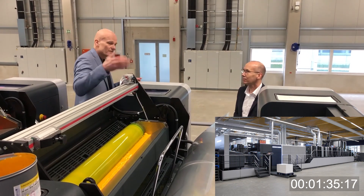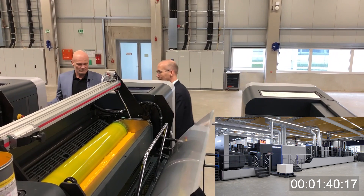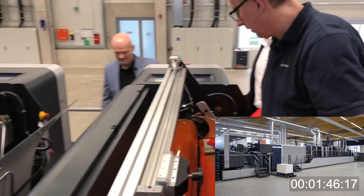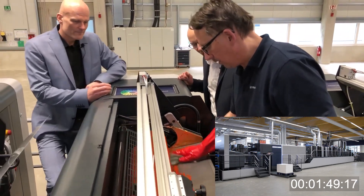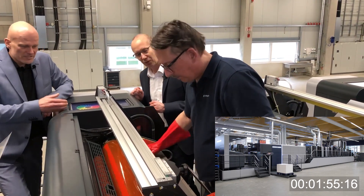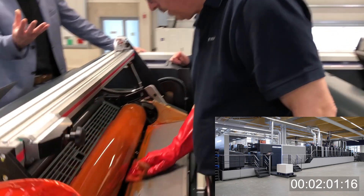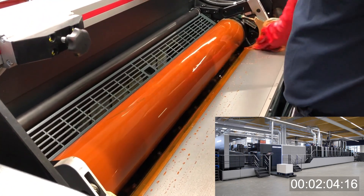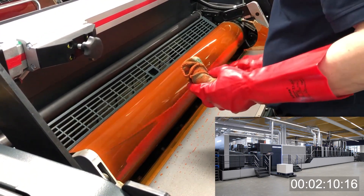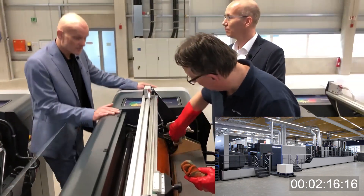The main drive is running the machine. Below the printing towers, we can show how easy it is to clean our ink ducts. There is a special solvent inside — it's an easy-clean feature. The surface looks like Teflon, and indeed it is a Teflon ceramic surface in the chamber. This surface repels the ink like a lotus effect. You can save a lot of time — around 50 percent time saving when changing ink in the whole ink chamber. That's a great feature.